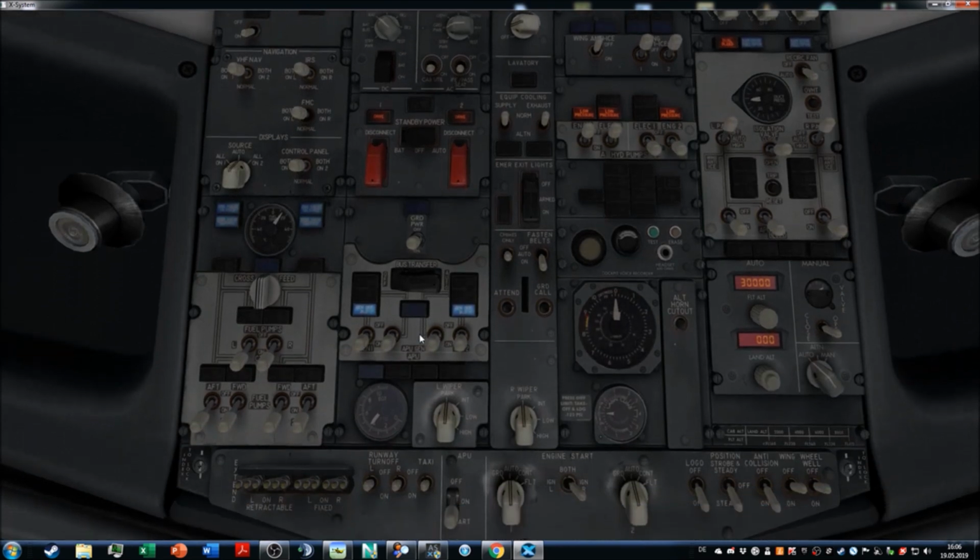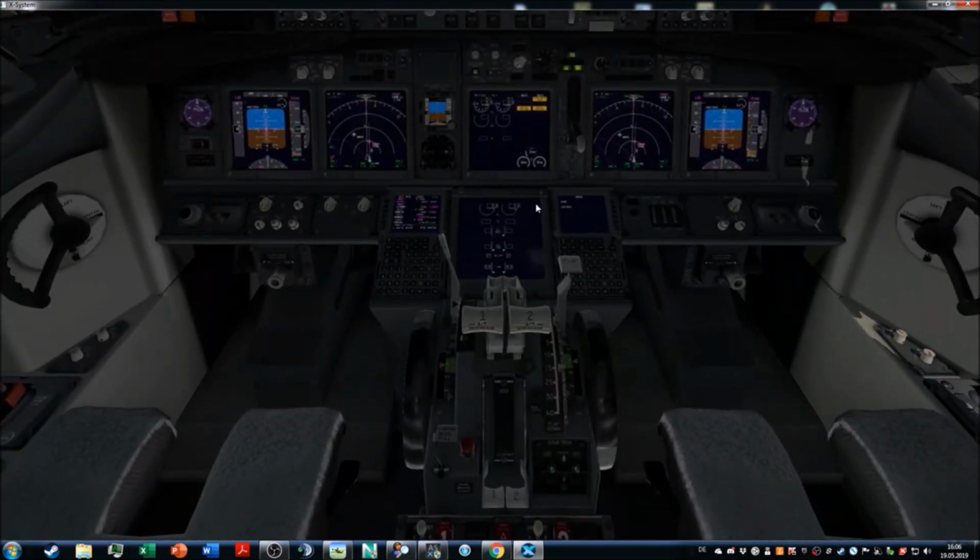Clear to start the engines. So right engine start switch, going to ground. And now, look down here and wait for this N2 reading to increase above 20%, at which point we're going to start injecting fuel in the engine with this little cutoff lever here.